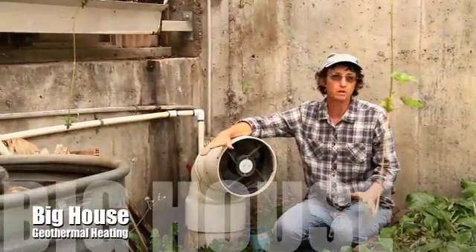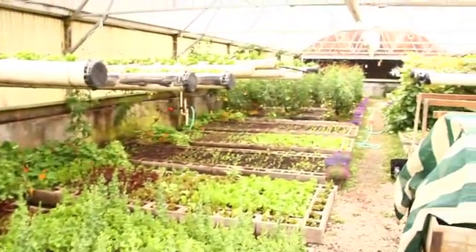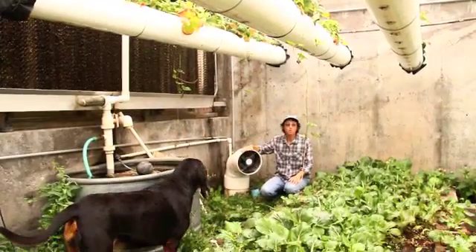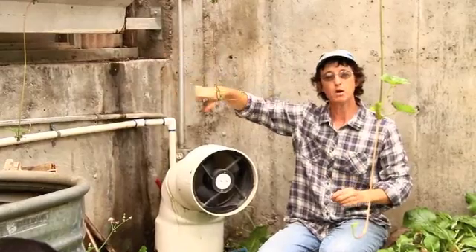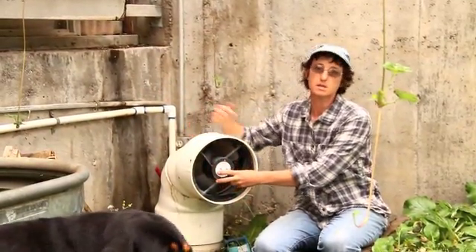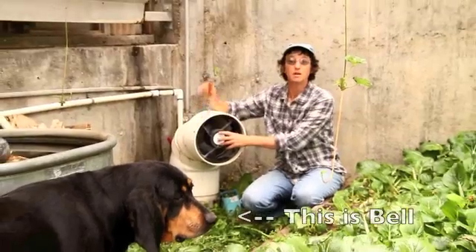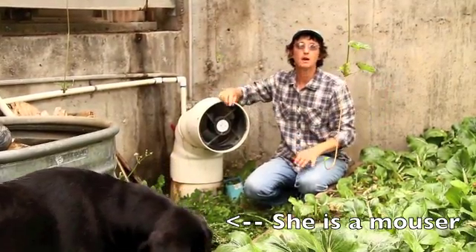So we are in the big greenhouse. This building is 30 feet wide and 100 feet long. We also do production year-round in this building. We used to have propane heaters in here but we sold them. What we did is install a geothermal heat system — a very simple homemade system. We have 175 feet of six-inch sewer pipe buried out in the parking lot six feet deep, so it circulates out there. We have an intake on the outside and a fan unit on the inside. When the building drops below 40 degrees, the thermostat kicks on the fan and pulls air through the system underground, blowing 40-50 degree air into the greenhouse.